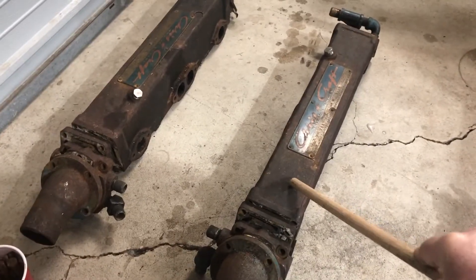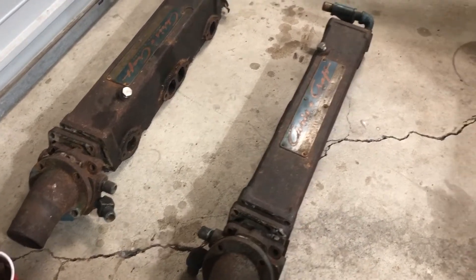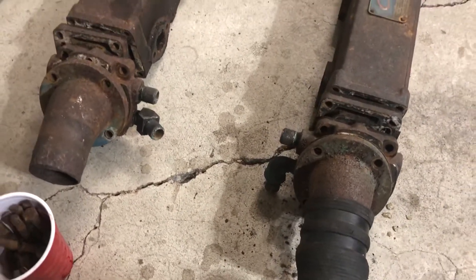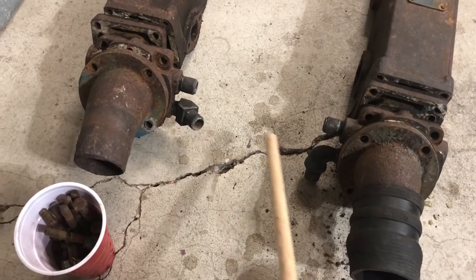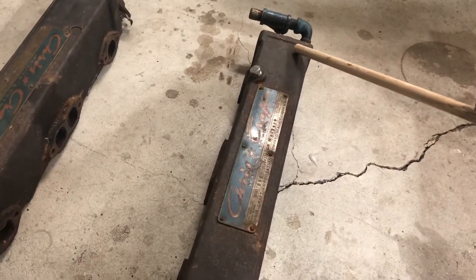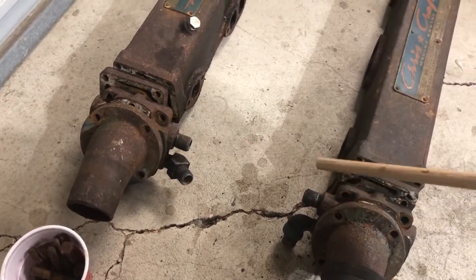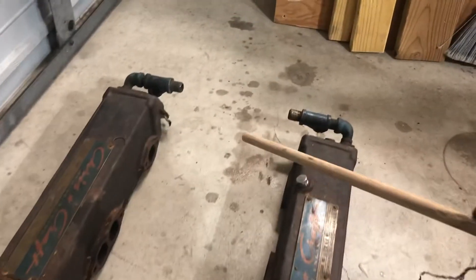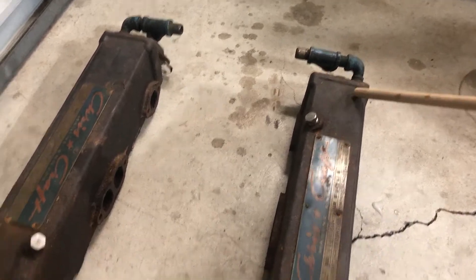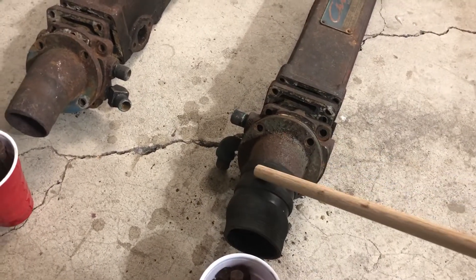What makes the configuration port and starboard are the distribution plates that attach to the ends of the logs. The water from the pump comes into these two nozzles here. It makes one pass down the length of the exhaust manifold and comes back to this end, discharges through these nozzles, enters the engine block, exits the front side of the heads, comes back into the manifold, makes one final pass, mixes with the exhaust gases, and exits the back of the boat.